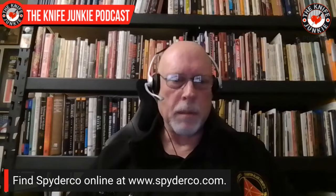For followers who may look at that and say 'that shouldn't happen' — there's a difference in heat treatment between knives designed for throwing and knives designed for cutting. Spyderco in most cases errs toward edge retention versus toughness. A true purpose-design throwing knife is Rockwell low fifties — around 52. A cutting knife is going to be at least 58-59, ideally more like 60-61, and with that hardness comes brittleness. That's a trade-off. To be clear, I was not using the knife for its proper purpose — I was being Jason Bourne when no one was looking and embarrassed myself. But I love that knife.